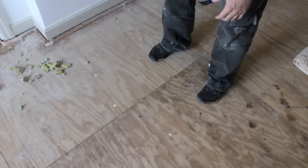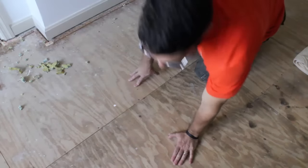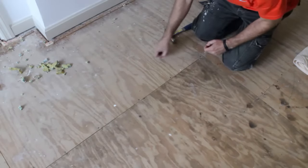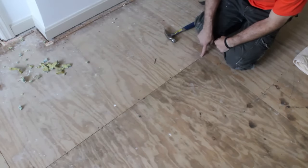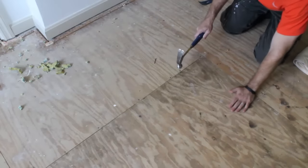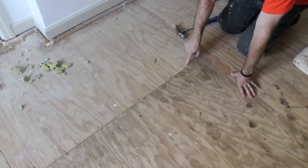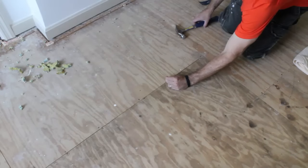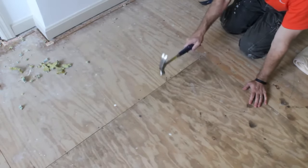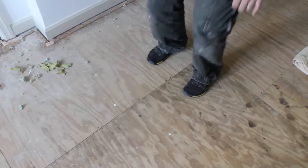Here's a big tip: check your subfloor for squeaks. If you're going to install hardwood floors, carpet, laminate, or whatever, you totally want to make sure that squeak is eliminated. You can do that by finding the joist, which is indicated by the screws that go through the wood subfloor. Line up a ring shank nail, tap it in place, and secure the wood subfloor more to the joist underneath it. Do the same thing with every screw that you see — secure either a ring shank nail or a 2-inch deck screw to eliminate that squeak.